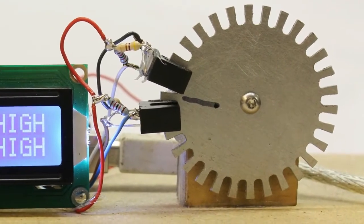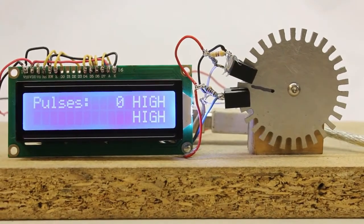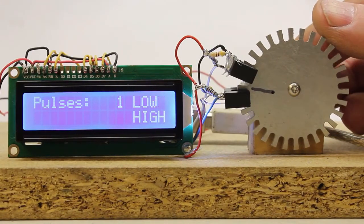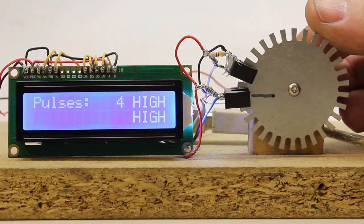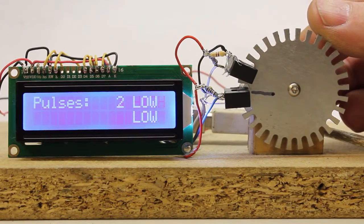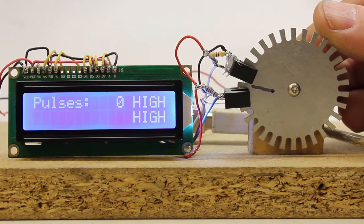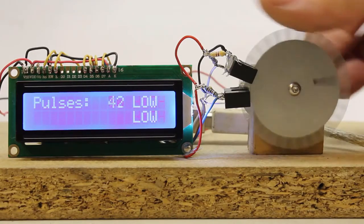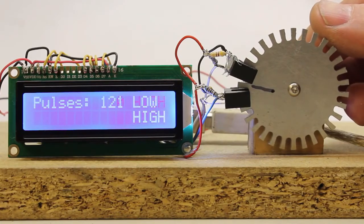In practice, the sensors are usually arranged as closely as possible. This sensor wheel has 30 teeth, each 2mm wide, and the distance between the center lines of the sensors is 27 degrees — two teeth and gap widths plus half a tooth width. We get 120 steps for a full turn and the arrangement works fine.